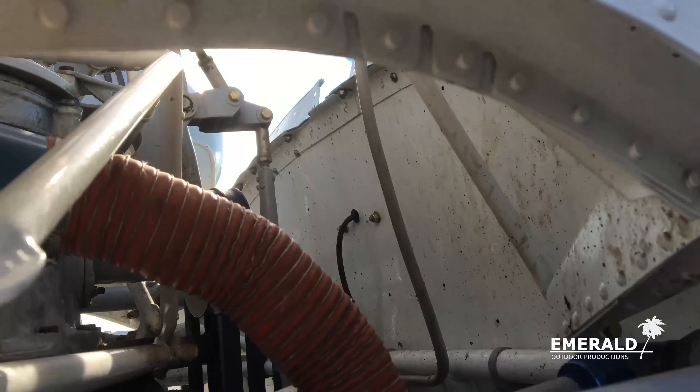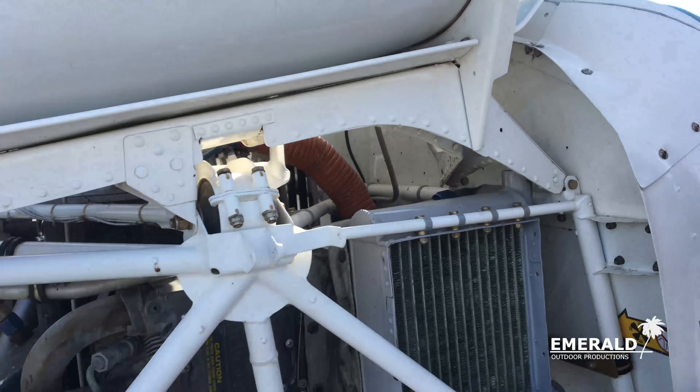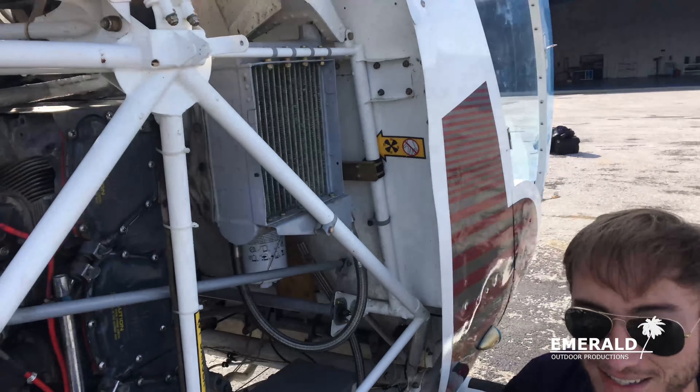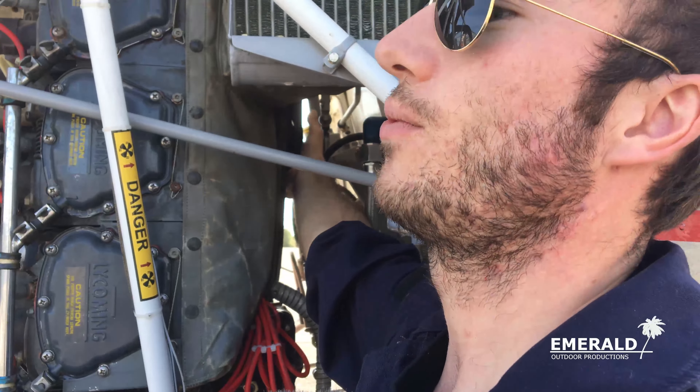You'll find several of those little friction rub points on the wires. If you're flying an aircraft for the first time, it's a good idea to take a notebook and note where those are so you can continuously monitor them and watch them — so you don't get surprised by a gauge failure. Always look for areas where wires start rubbing, because it is a helicopter and it does like to vibrate.